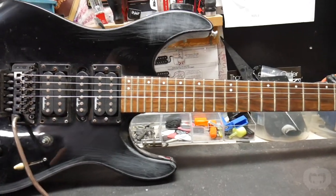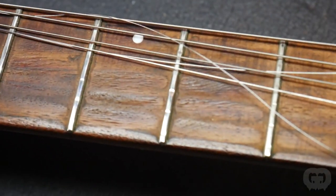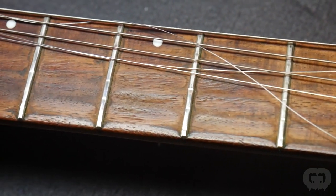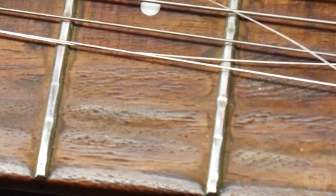Since I'm going to be taking the neck off to repaint the guitar, that's when I'm going to refret it. The frets on this guitar have been badly worn down from years of playing — they're very flat and have a lot of dead spots. Flat spots create vibration and buzz on a guitar, which is no good. The frets should be rounded, like the illustration shows, but over years of playing with metal strings grinding against them, they flatten out. Sometimes this can be repaired and refiled, but in this case I believe they're way too worn and should just be replaced.